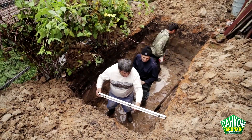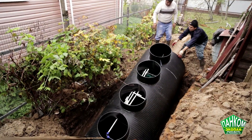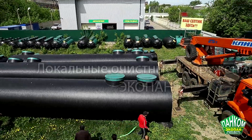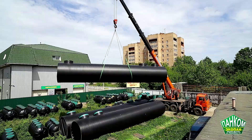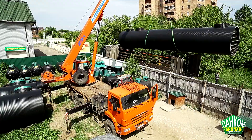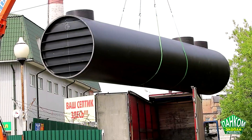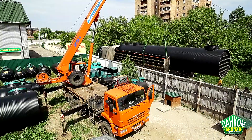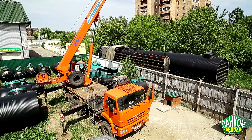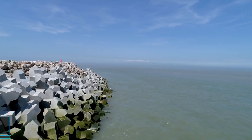Many models are ready for installation and work in difficult conditions — for example, on soil like clay and quicksand. They offer a high level of wastewater treatment and a durable housing made of sheet polyethylene. The body is made of a spiral twisted pipe; the ends are solid cast products with double-sided reinforcement.